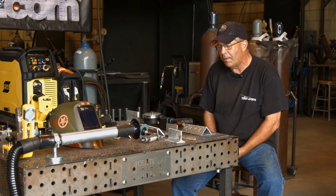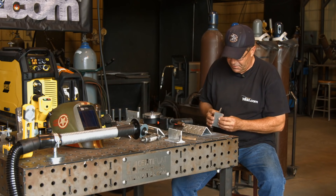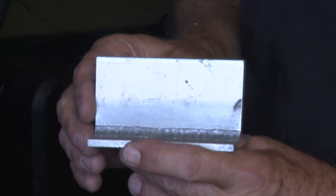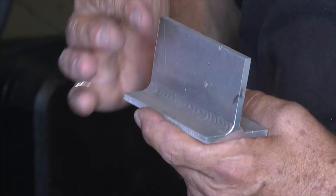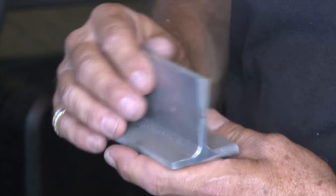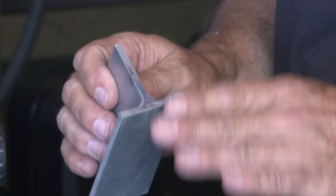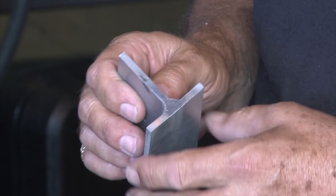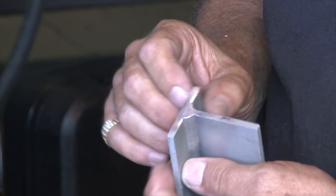Here's the problem that I see. We did a little sample a long time ago and I've lost my etch here - I kept my polish. One of these is clearly a push, and to my understanding that's how you should weld aluminum. You get more of a cup and a concavity in the weld. Over here we did a small pull. Both of them look acceptable, however when we cut and polished it I noticed minor amounts of porosity on the pull side and nothing on the push side.